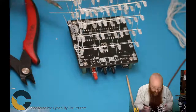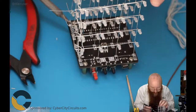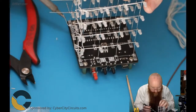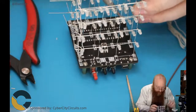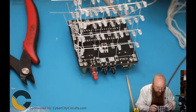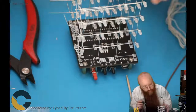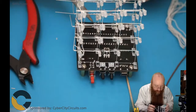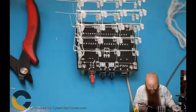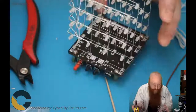So I think, whoops, I'm going to get you to the correct height like that. Yeah. Do the same thing on this side. Why not? I'm going to solder it. I'm going to hold it up. I'm going to remove the heat. I'm just going to hold it in place. And then voila. Now I can do the middle ones. Well, that's a handy tip. And now I can do all of our negative joints.